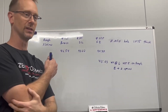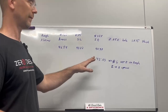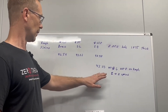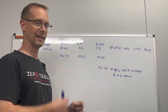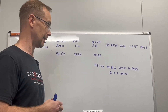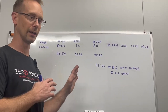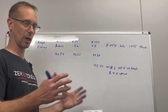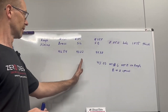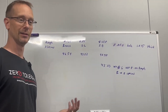The high-end wire does some very cool things — we've seen it go through pits, bad conditions, weld, and porosity in steel. There is a benefit to this type of wire, but in most cases for what we do, we're working with good materials and haven't had a big need for it. One thing that is cool: you can slow the wire feed from eight to six and increase the E-adjust on our Mitsubishi, which uses less wire and reduces wear on rollers and bearings. So there's a maintenance factor that justifies the cost if you're running production — same parts over and over, or large pockets. But for us, we're going to stick with the SL zinc-coated wire. It's a little more than straight brass but it does go faster, and having one machine makes that worthwhile.